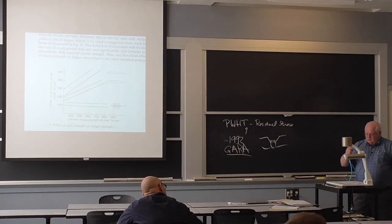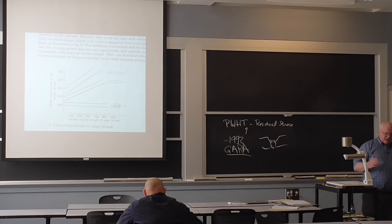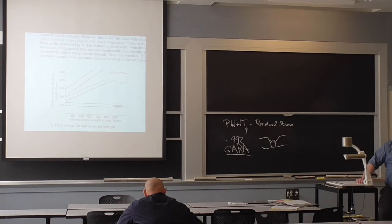To give you an example, in 1985, Ford came out with the Aerostar van, and they were using high-strength, low-alloy steel for the first time, rather than regular old carbon steel sheet. They designed the rear axle to have a fatigue strength proportional to the tensile strength, because that's what their designers knew. That would be true if they hadn't welded it. But the rear axle had some brackets on it, and it was welded, and they found out people's rear axles were fatiguing off in the first 6 months. This was not a good day for Ford, okay? Then they had a product recall and stuff.